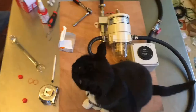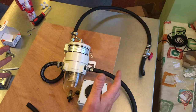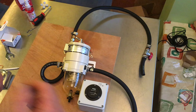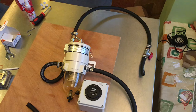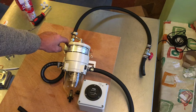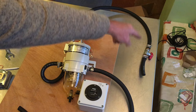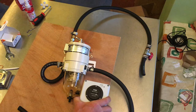Now you get a better idea of what we're doing. This dimension here is the size of the case this is going to go into — at least I think it is. Unfortunately I bought a second-hand one on eBay and it seems the courier has lost it, so I'm not going to cut the board and mount everything until I know I've got the right case. But broadly speaking the concept is pretty clear: infeed here with a copper tube about a metre length dipping into the bottom of the fuel tank through the filter, then it sucks through the pump — that's the most efficient way, with the pump on the suction side — and the outfeed goes through another pipe back into the tank. We've got our control box with the switch and the counter, which will need to be wired up.